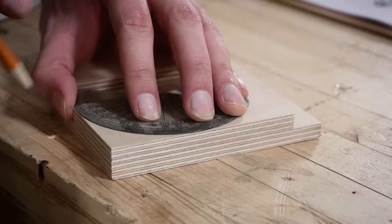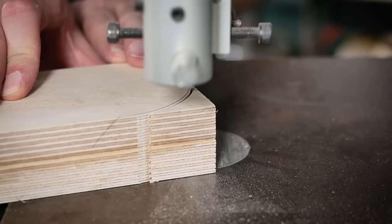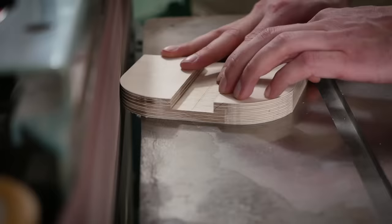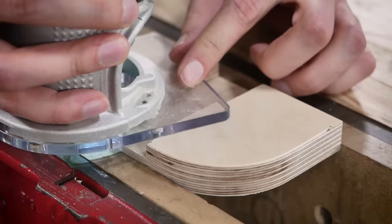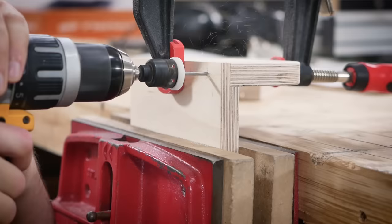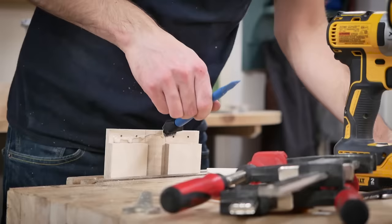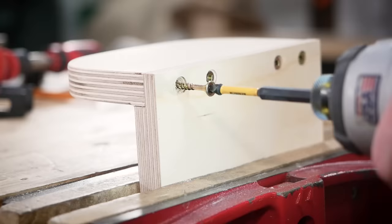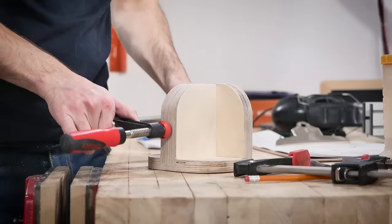I added a radius to the exposed corners of each of the guard parts so I don't cut myself. You can do this with a jigsaw or bandsaw, or sand the part with a belt or disc sander, or hand sand it. I'm also going to round over all the exposed edges with my palm router. To assemble the guard bracket, I clamp everything together temporarily to countersink four holes where the bottom meets the dado turned rabbet, then add glue and screw the bottom part into the rabbet. Now I can glue the laminated piece and only clamp it — do not put screws in this because the blade will hit them.